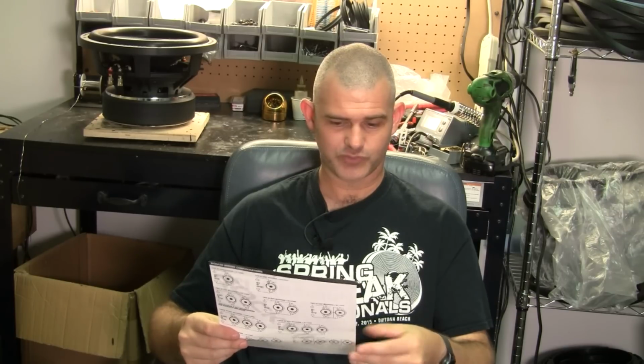That leads us to the RE, and they list it as the dual coil in 4 ohm plus or minus 0.2 ohms, and parallel is 1 ohm plus or minus 0.2 ohms. Well, that's not RE, that's nominal. Those are different things. So if you're going to go back and compare your BL squared divided by RE, you can't go off of that number because you don't know the exact number that all the other parameters come off of to make that comparison. It's wrong.